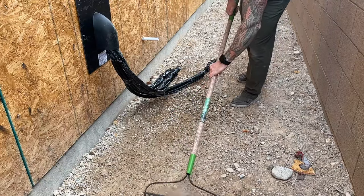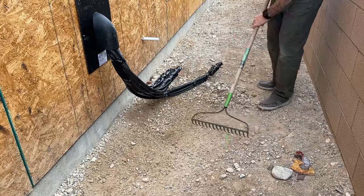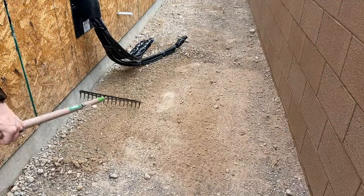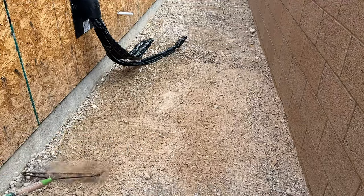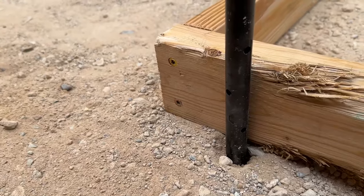When you're pouring concrete, you do need to prepare the dirt a little bit. Here where I'm going to be pouring, I already have some pretty good foundational dirt — it's the dirt still here from where we poured the casita. The surrounding dirt has a little bit of small rock in it. So I just cleaned it up with the rake, got it generally flat, and then went and got myself some form stakes.